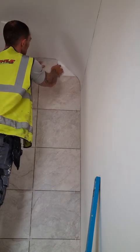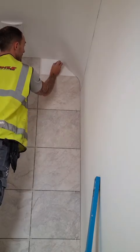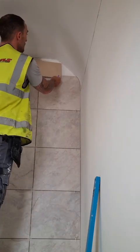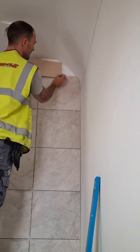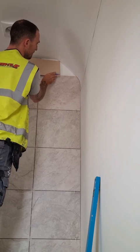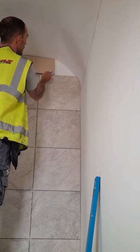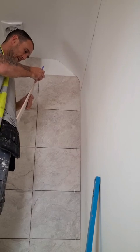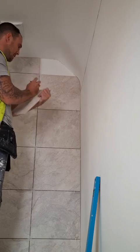Using the straight side of a bit of tile, draw a couple of lines in between and evenly space them out, then mark it down on your cut tile. When marking, make sure you leave space for your spacer — we're using two mil on this one.